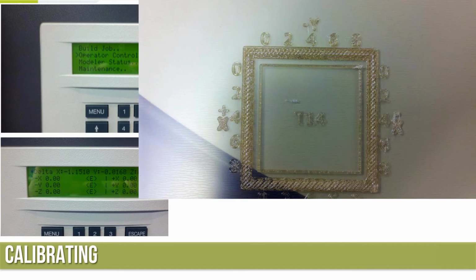If we've seen this print once, we've probably seen it a few times. We've got a bead of plastic in between the two rows here. We want to find the value where we are centered up nicely between the two sides of the rows. Okay, punch those values in. If they're a ways off, we may want to go ahead and rerun the calibration job. We also need to measure the thickness of the top center bead in this middle rectangle,